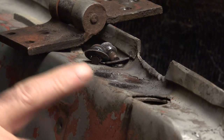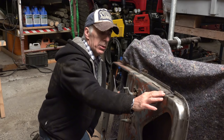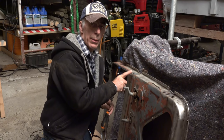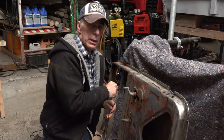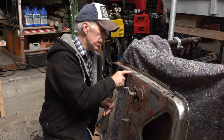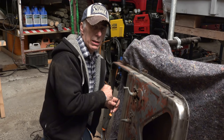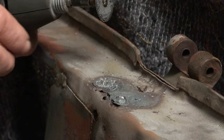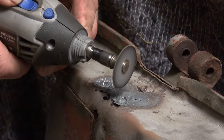We got real lucky removing the bottom part - it doesn't always work like this. We were able to get the bolts out by heating them up. But the top part - I tried the same thing and can't get them out, so now I'll have to drill them out. I don't have a reverse bit so I'm going to use a normal bit, drill a hole in it, and try to get the top off. The bolts are a bit concave so maybe I can drill them out without damaging too much of the thread underneath. Drilling out is always hard with a slotted screw because the bit jumps around.